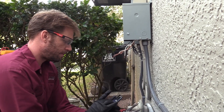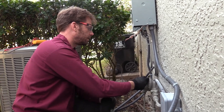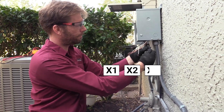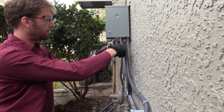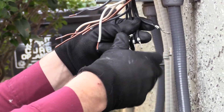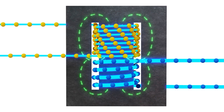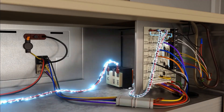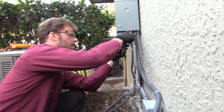I have the wire diagram and install manual pulled up on my phone as my reference to make sure I get this installed right. First thing: all of your wires are labeled X1 through X4, and then we have H1, H2, H3, H4. Depending on the combination, that determines how much you buck or boost. That's how any transformer works — come in one direction, you're transforming the voltage down; come in the other side, you're boosting it up. Same transformer, turn it around, hook it up, and your voltage will be increased instead of decreased.